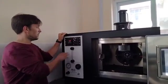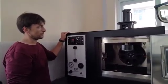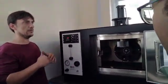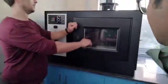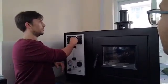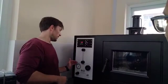We can set the temperature — it's set up at one hundred and sixty-three degrees, that is the standard we are going to use. You have to preheat the oven; it has to reach the temperature within ten minutes, but that's not really too important. You have to wait until the oven has no temperature difference. We're going to close the door and preheat the oven without the samples in, so everything is nice and warm. We are also going to switch the blower on, which is going to help stabilize the temperature inside.